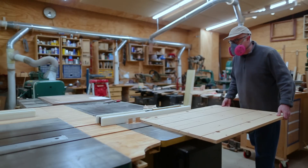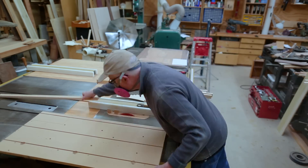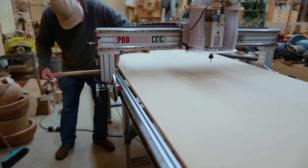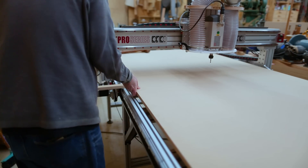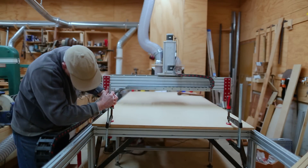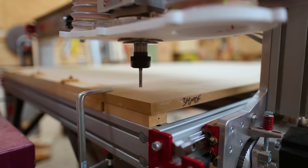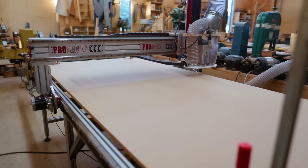To attach the new spoil board, I need to cut the holes for the bolts into it, and I need to hold the spoil board up off the frame while I do that. So I cut some spacers and put those under the spoil board to hold it up so I won't damage the aluminum when I cut the bolt holes. Then I clamped the spoil board down at each end. I couldn't do all the holes at once — I did one end, then once that was done I could put clamps there and do the middle, then do the other end.